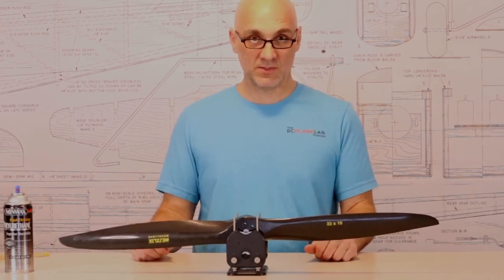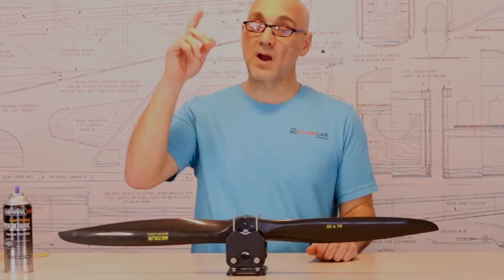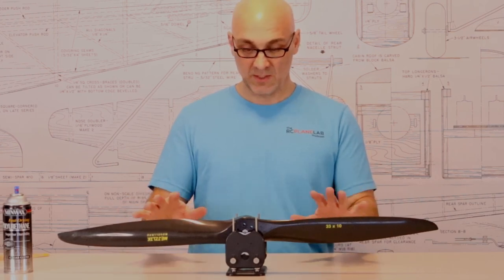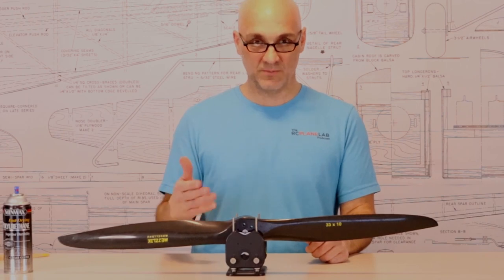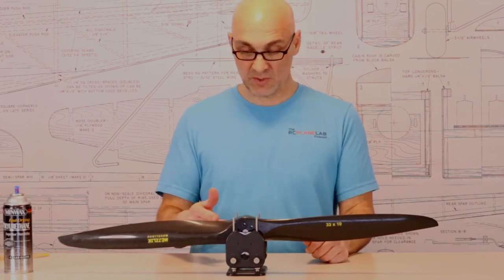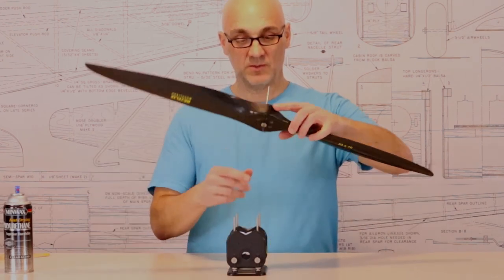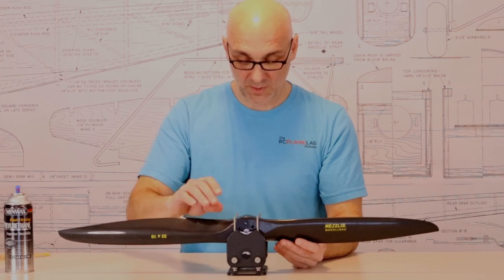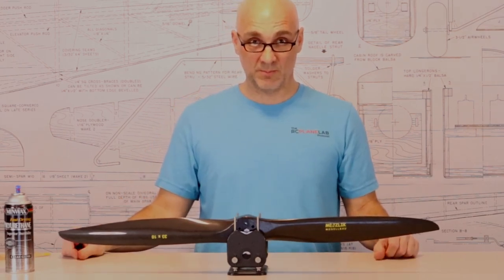Air currents, things like that. If you're using this thing next to an air duct, which we've got one above us here, Ron had to shut it off, that will affect larger propellers because it does get more sensitive, the heavier prop you go. But as you can see, this one's pretty close. I'm going to go ahead and flip it over just to show, for consistency's sake, this prop pretty close to being perfect.